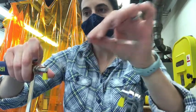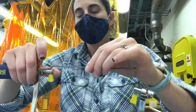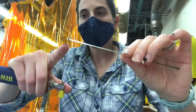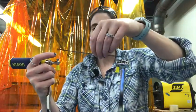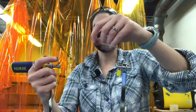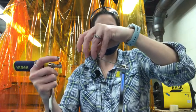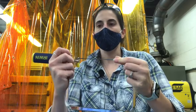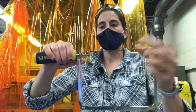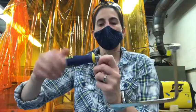I can then slide one side in - this is the T part. Note that these little pieces come out sometimes, so be careful. To put it back in, you want your T pointing down so that it can cut. You're going to slide it into one side, then push tension on this end so that it can slide into the other side. Once it's in, I hold this so it doesn't rotate and I rotate clockwise to close it.